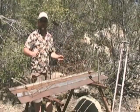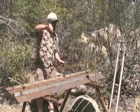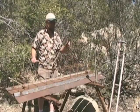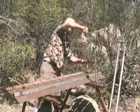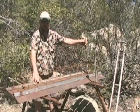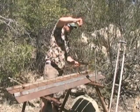I call this the vampire cross, because it looks like a vampire cross — and the stake. The idea is just to hook this under each one of these wires, and we use this as a bridge that goes underneath and through the block. This one goes on top just to make a crimp on this side, so that these two links will be shorter than the outside one, so it'll make a nice radius that's flexible for many curves. Just go along like this.